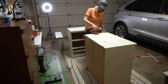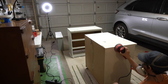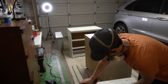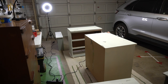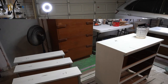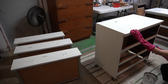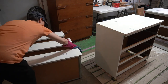The original top coat was a dead flat varnish, and the underlying pieces are thermofoil-coated particle board — not solid wood, and not the sturdiest, but that meant they only needed a scuff sanding to get a tooth for the paint. After sanding, she wiped everything down with a clean rag and warm water, then left everything to dry — which took about five minutes in Phoenix.